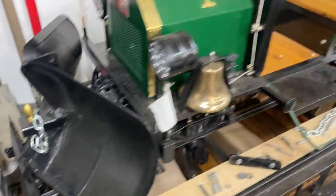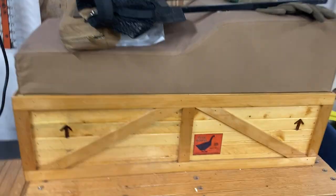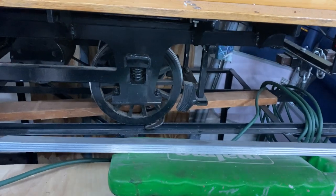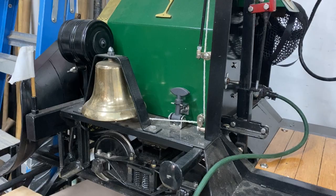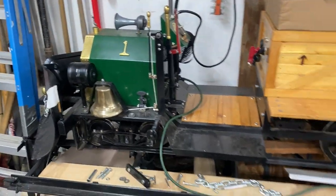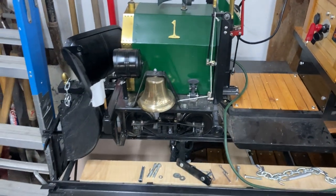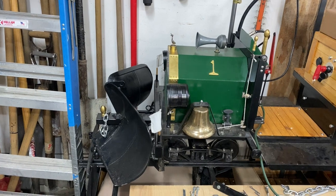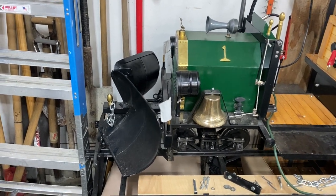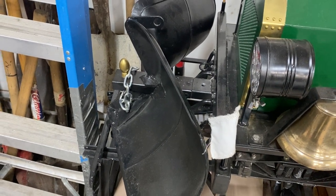When my wife and I are riding this tandem — it's kind of like a snowmobile — you can see where the axle is. There's a fair amount of weight on that axle and it tends to make the front end a little light. I found that if I didn't lean on the footboard a bit on lumpier tracks, sometimes the front truck could jump the rail. I needed a little extra weight, and you can maximize the effect by hanging it way out over the fulcrum.